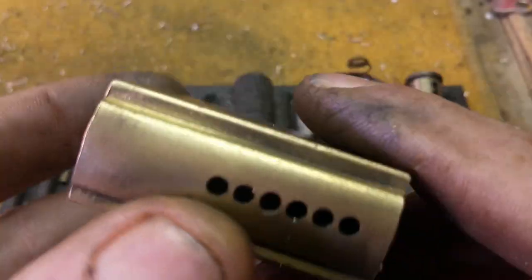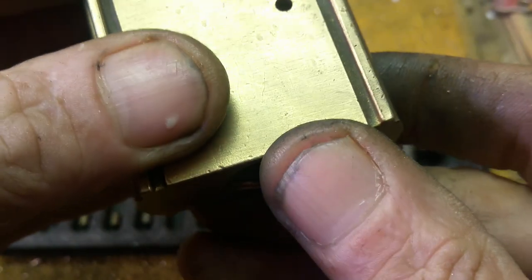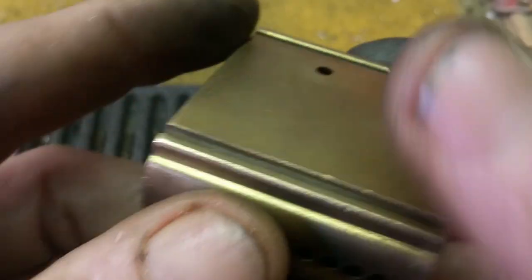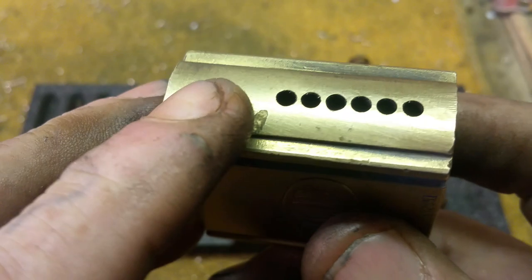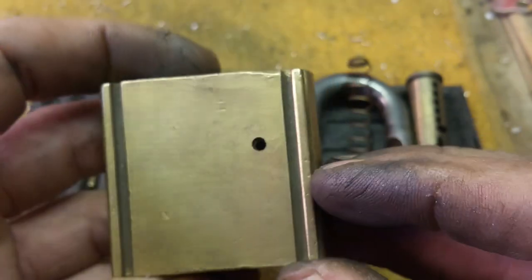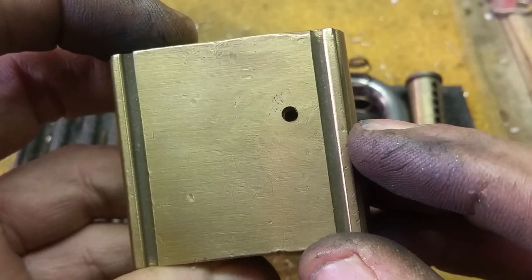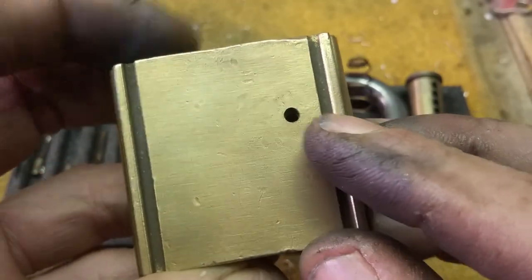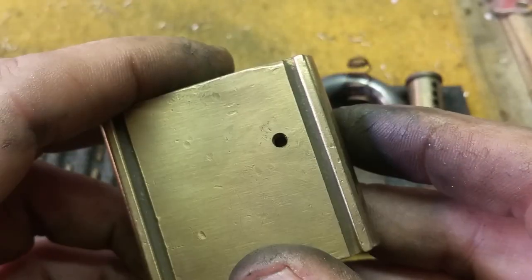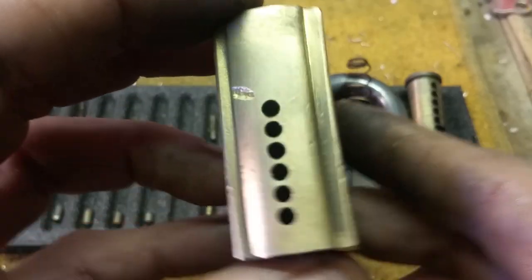Ready to go, basically, ready to refurbish. This one again, this has been taken apart, by the way. I'll show you why. Someone's put the wrong part in it. That hole should be smaller than the chamber holes. But it's not, so someone's obviously put a chamber plug in the shackle retainer pinhole, and they've blown it out a bit, which is not a problem. I'll just replace like for like, not a drama.